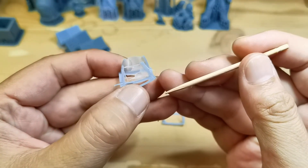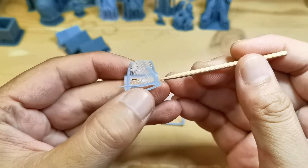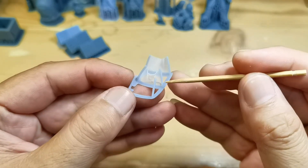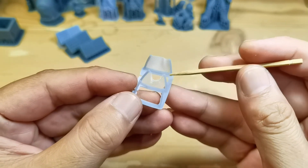For the wire mesh model, the 0.1mm and 0.2mm wire meshes do not survive at all on straight wire mesh. On the tilted wire mesh, the 0.2mm printed very well, but 0.1mm still fails.